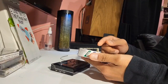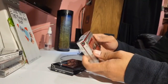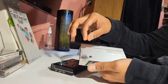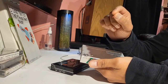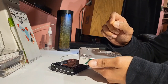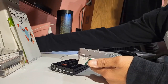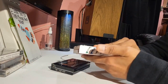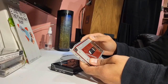These things have a flexible PCB, meaning it's like a piece of paper, you can roll it. So they roll the PCB and put it in the side, there is a sleeve, like a pocket for the DC-DC converter. When they do that, there is a jumper, an SMD jumper, extremely small, probably as big as the tip of this piece of wire. So when you roll that piece of paper over 30 years, I think it gets desoldered and dislodged.